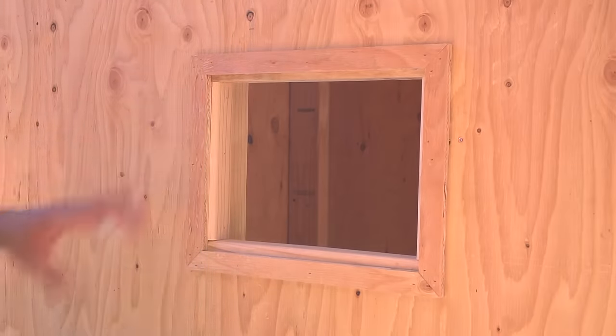Now that our framework is taken care of for our chicken coop, we can now work on our chicken run. This is going to be a fenced-off area right behind the large chicken coop we just built, so our chickens are free to roam, pick up the grass, and be safe while doing it. This section is going to be 8 feet long, have the same angled roof line, however it's going to be slightly shorter than our chicken coop. This entire system is assembled and fastened together using the Kreg pocket hole jig and exterior screws, and I am placing a pressure-treated 4x4 post right where the door is going to be because I want to make sure we have plenty of structural support.